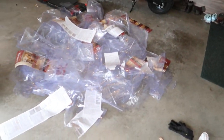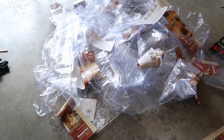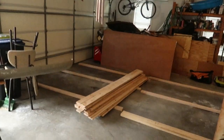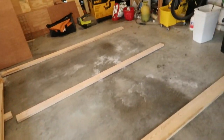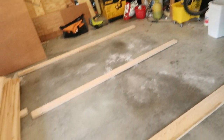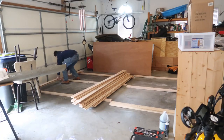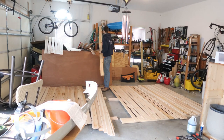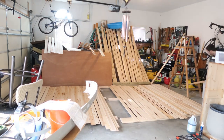What's up everybody! I have just unwrapped all of the cedar planking for our ceiling inside the bus. All of these individually wrapped packs of boards generated a lot of plastic, but it seemed like a good way to buy it at the time. Now I'm going to lay them out on two-by-fours — basically racks I made — so they can acclimate to being outside. We want them to sit in the garage, which is going to be kind of like sitting in the bus, and they'll expand or contract as much as they will over the next day or so, and then we'll be able to seal them and put them on the bus.